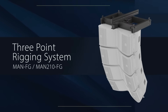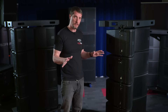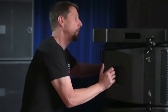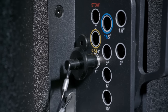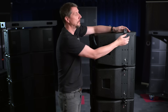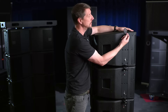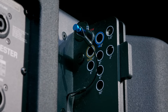The MV212 and the XV come with a three-point rigging system. Everything is integral to the box — you don't need to buy any extra pins, and everything is also lanyarded to the box. If I move this round, you can see the third pick-up point, and all of your angles are marked here. Our front two pick-up points are spring-loaded, which enables the pick-up point to leap out of the box, making for a smoother rigging process. Just replacing pins back into the holes they've come out of will make the system secure.